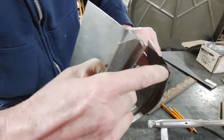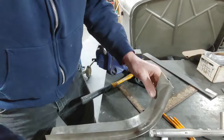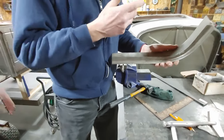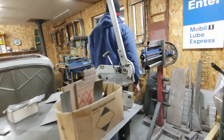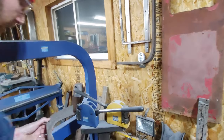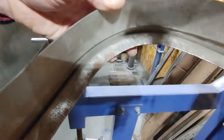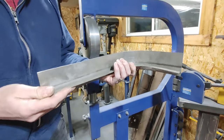Basically: form your bead, bend it over. This still would have to be flattened out to get a nice thin piece all the way around. Then in order to form it around the cab corner, I simply just stuck it on the shrinker. I took a straight piece and kept working it in the shrinker, back and forth, until I turned the right edge onto it. So that's the one top of the cab corner.